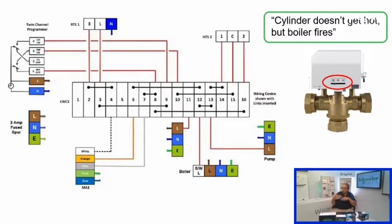So I would now go through and sequentially remove links and test number 12. So isolate, remove link, power back up, test, and see when 12 goes dead, and then identify which link it is that you've removed, and that will then push you to where it is.